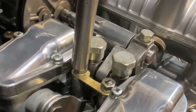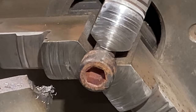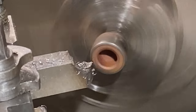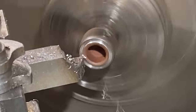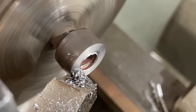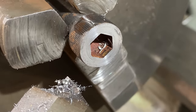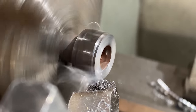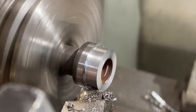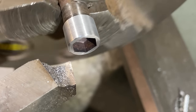The next thing I'm going to do is make the 8mm socket from the M10 cap head bolt. I grip the cap head bolt in the three-jaw chuck so I can turn the head down so it's slightly smaller. I first reduce the length slightly and face off the front face so it has a nice sharp edge. With the front face machined, I use an Allen key to deburr. I then start slimming the diameter, reducing it down a bit at a time until it's just bigger than the hexagon inside — it needs to be as small as possible so it can fit down between carburetor bodies.